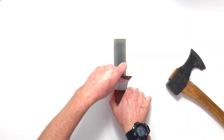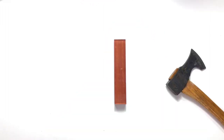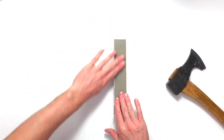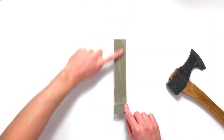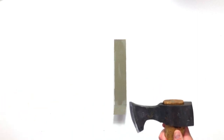I'm going to smudge that water in — same thing again and I'm going to go at my normal speed; I might even skip this because there's no point in repeating it over and over. So the final grit now — pull that off, we're going to move on to our 7000. This really is how quick and easy it is; there's nothing going on behind the scenes, it's literally me peeling and sticking sandpaper with no mess, and that's what I love so much about this system. I'm going to wipe that edge again to remove any of the previous abrasive.